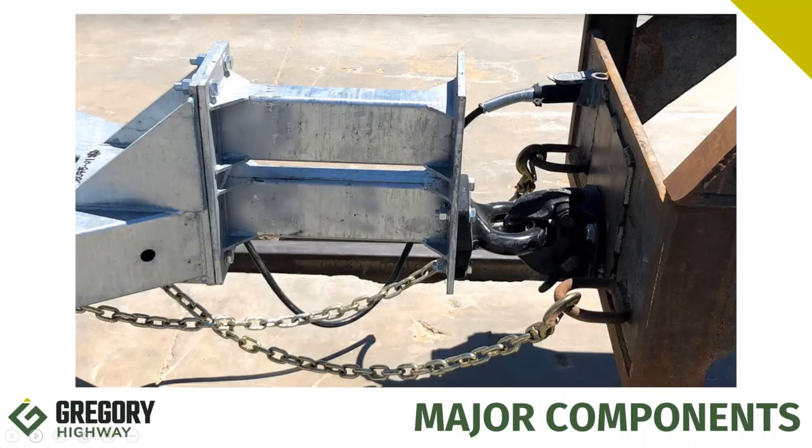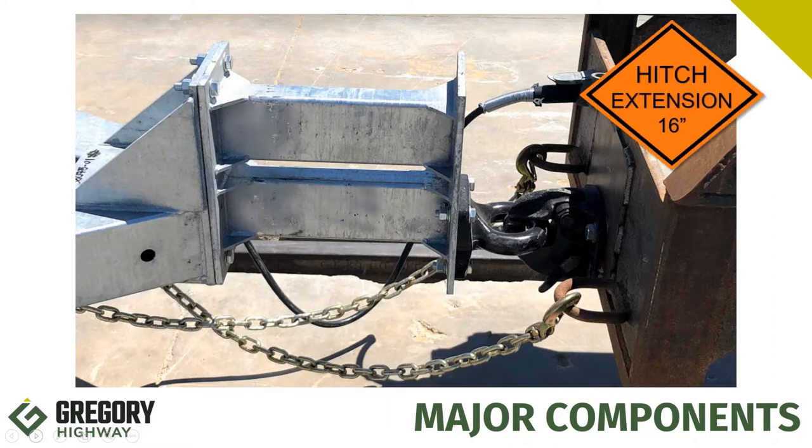When the lunette ring is attached to the pintle hitch, this will create a point of rotation during the impact event. We will cover this in more detail throughout this training, but it should be noted the rotation is designed and part of the impact process. In instances where the pintle hitch attachment may be recessed or additional length is needed to aid in turning clearance, a hitch extension is offered as an option. This hitch extension is 16 inches in length and was crash tested during our MASH testing.